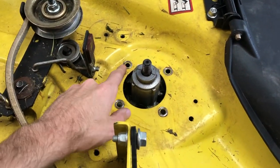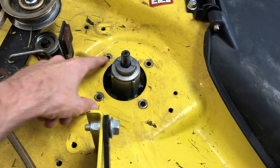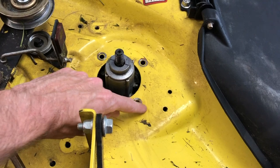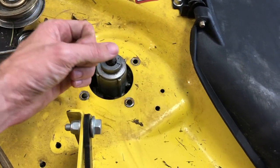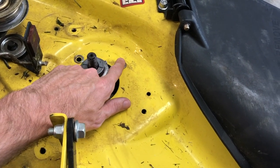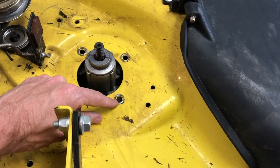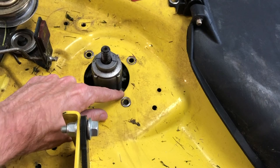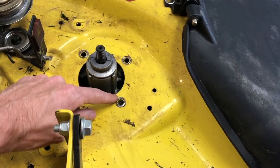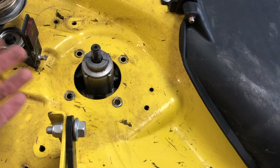I went ahead and removed the four bolts that hold the spindle, because these back two holes look like they're dimpled down — it's dented locally around there because the whole spindle twisted and kind of pulled these, and then this whole section is raised up a little bit. So I'm going to see if maybe I can just flatten these out, do like a hammer and dolly, some body work style — put a hard surface on the back and hammer from the inside of the deck. Maybe do the same back here, then bolt everything back together and test it out.